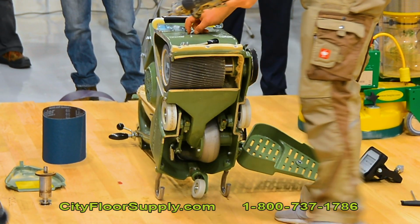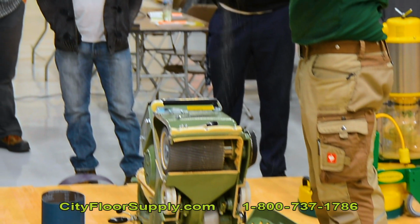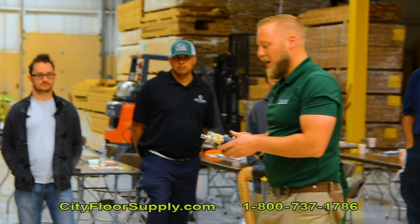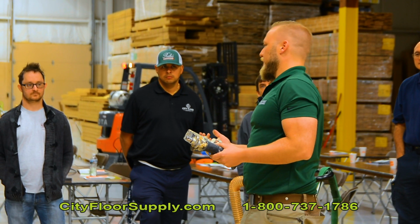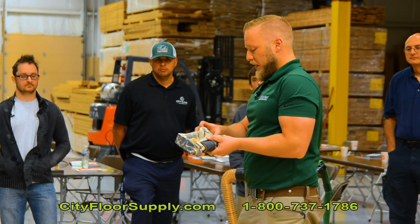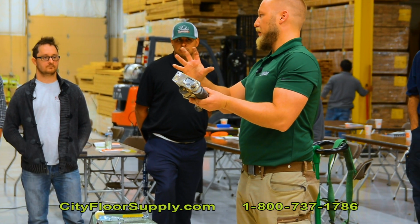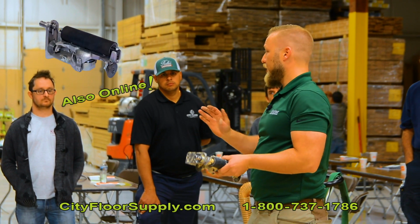There you go. I just sanded the floor yesterday, that's why it looks so bad. That's all it takes, 3 screws to take it out. Vacuum it out. I'm not a fan of blowing out machines because you push dust in places where it doesn't belong. If you keep your distance, it's fine, but especially the upper roller unit, if you push the dust inside that collar, it will expand, it will actually push all the pieces apart. So this piece, only use a vacuum, clean it out, call it good.